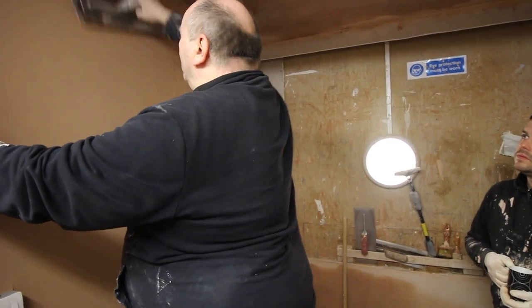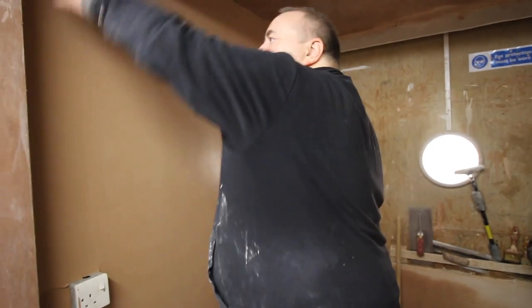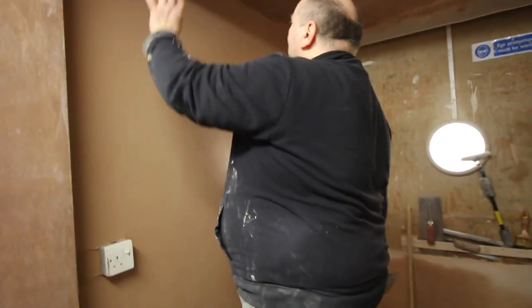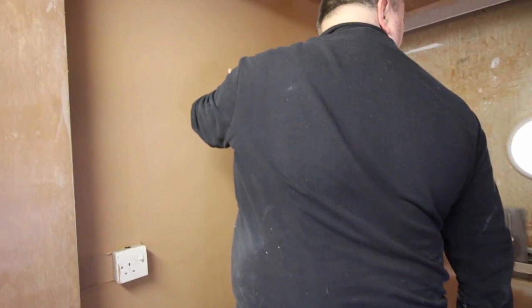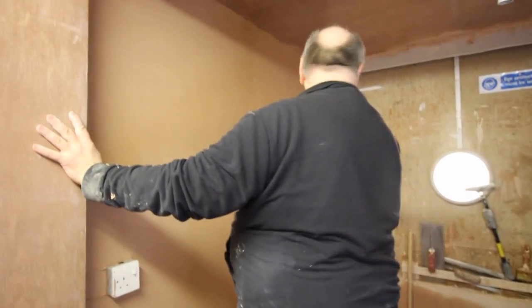So basically what you would do, once that's done, down, round and off, before you go to give it a polish, the next thing is you just brush your angles. There's no stuff to wipe off the ceilings or the corner. You should fill up any wee holes you've left. You're still not going to get rid of all these lines because the wall's still soft, so you're not going to fill it up 100%. You're probably half the size of the lines now.